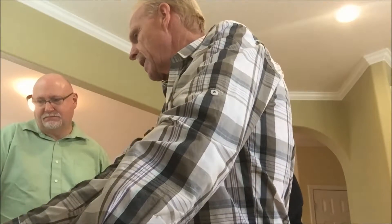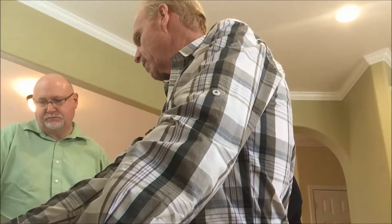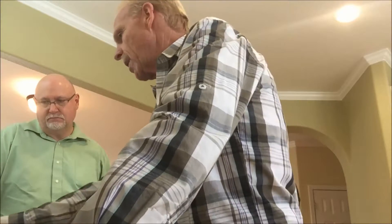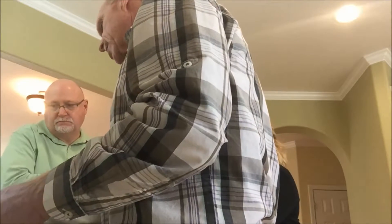On the master bathtub, the overflow cover — in case the water gets too high — is just real loose. On the back side of the tub there's a black foam rubber piece that goes up against it. As you tighten the Phillips screw on this side it pulls it tight. I don't have a leak — I can look right over the top of it, it's actually dropped down. Someone's going to have to loosen that screw a bit, pull it out, bring it up, get it seated, then tighten the screw so it pulls in tight.